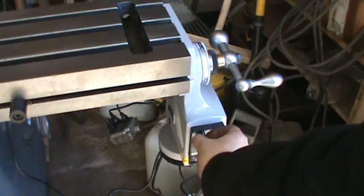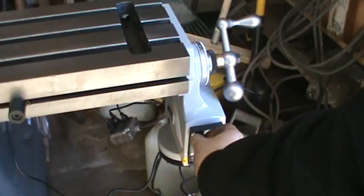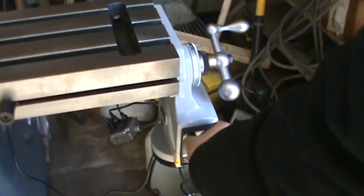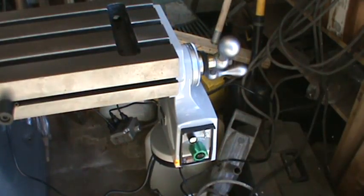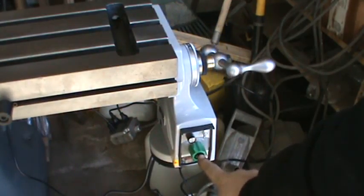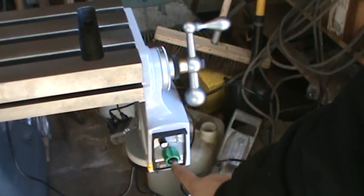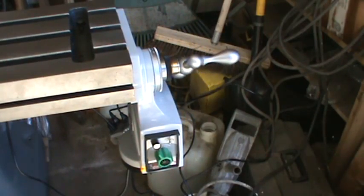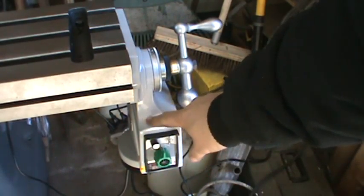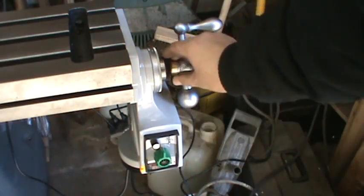I'm going to turn the speed down a little bit — that's all the way up. You can hear it's nice and smooth. You can run it down to the lowest speed and it just moves along super smooth, and that's because of the spiral bevel gear. The rapid is in the center here, which makes that a very nice function you can actually use, instead of having the button up here where it always gets broken off. It's a super innovation — they use a spiral bevel gear inside of here.